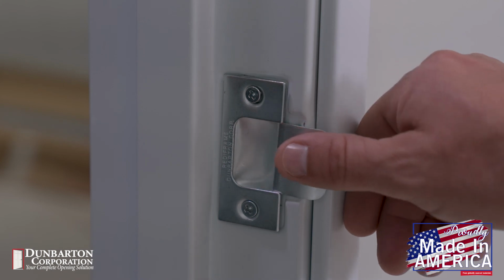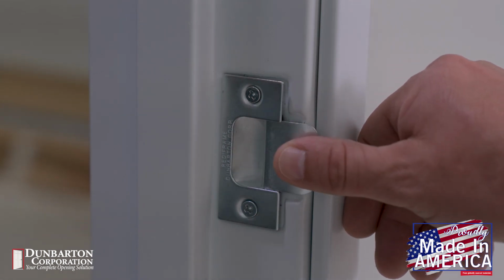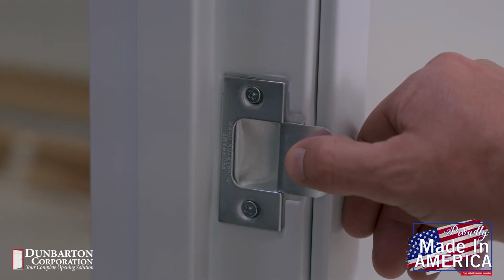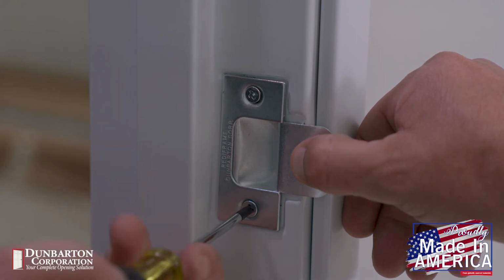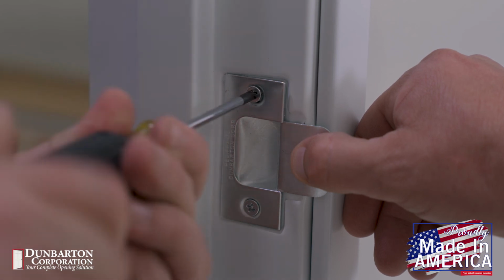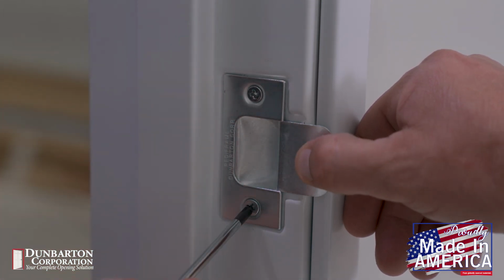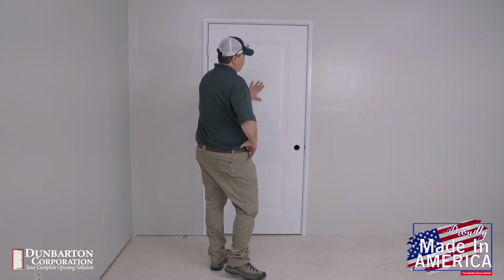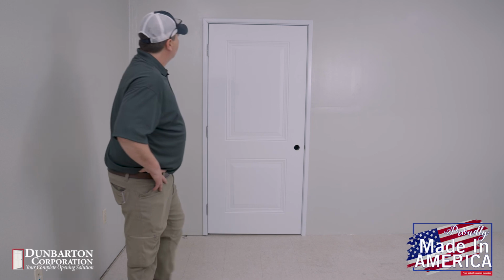The RediFrame installation is now almost complete. All that remains is to attach the lock set and the strike plate. If frames were ordered with RediFrame's adjustable strike plate, it is a two-piece assembly. To install, fully tighten the strike plate screws. There will be a rattle-free engagement of the latch by the strike plate. This means no more rattling interior doors when exterior doors are open. The RediFrame installation is now complete with minimum of time and effort.